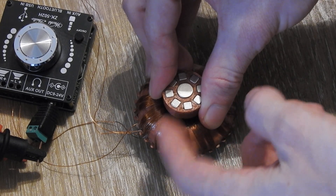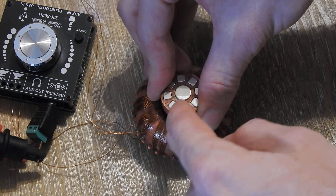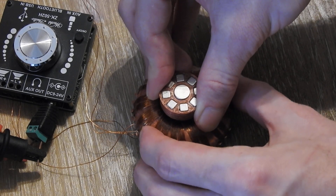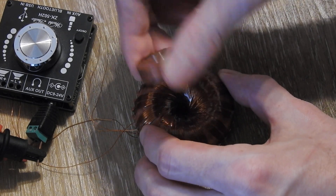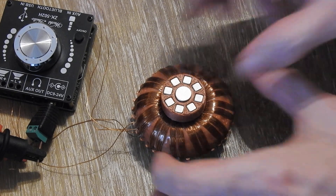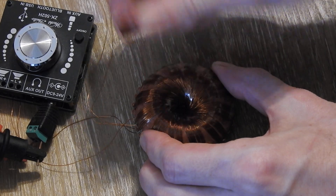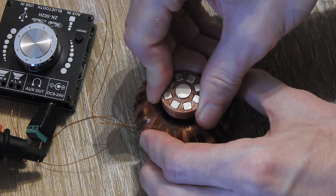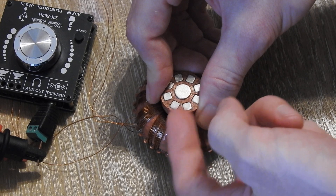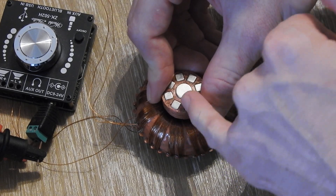Also this array starts to vibrate a lot. I think the gap between the hole and the magnet array itself influences how the frequency spectrum of the speaker sounds. Because if I flip this array and make it attracting, it doesn't sound as well. Also when I increase the distance by one millimeter, it sounds different than when I turn it around and put it at the exact same position while repelling. I guess this is because this magnet array itself is vibrating and is therefore responsible for the bass frequencies.